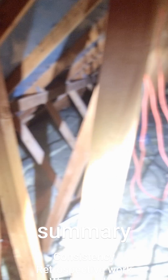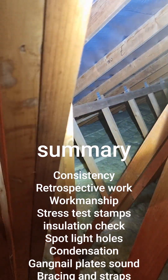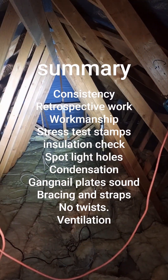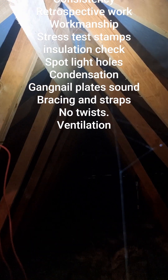I will be lifting the insulation — I'm not doing that now because I've taken my mask off, so I don't want to disturb anything, just for the purposes of the video. But all in all, this roof does look fairly sound. This is a roof that's hipped at both ends. I'll take a quick look at the apexes as well to make sure the gang nail plates are fine and that none of the rafters are twisted, and that's what we do.